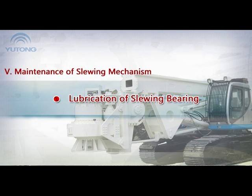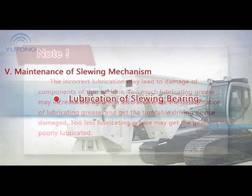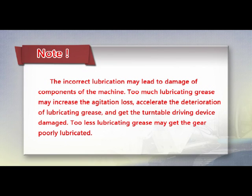Lubrication of slewing bearing gear. Note, the incorrect lubrication may lead to damage of components of the machine. Too much lubricating grease may increase the agitation loss, accelerate the deterioration of lubricating grease, and get the turnable driving device damaged. Too little lubricating grease may get the gear poorly lubricated.